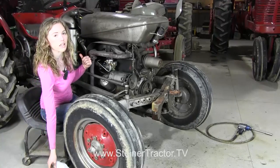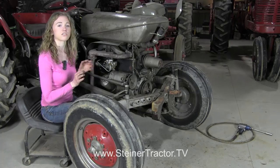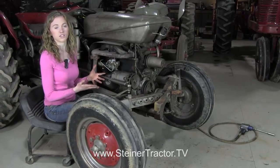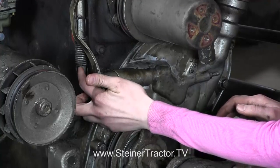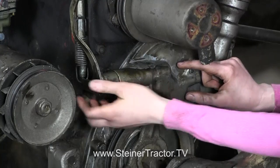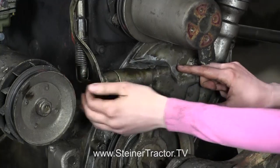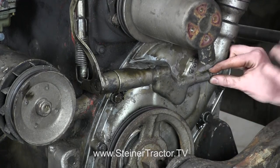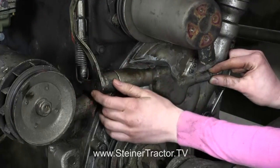We did reconnect the battery cable and start up the tractor to hear it run before we put it all back together, in case there were other adjustments we needed to make. Our tractor runs great just how we would want it. If you did your adjustment properly, this rod will touch this arm. However, if there is some play and your rod isn't touching and it's wandering or moving around at all when it's on idle, then you can make an adjustment with this screw here — just move it half a turn at a time to take that play out and make sure the rod makes contact with no wandering on your idle.